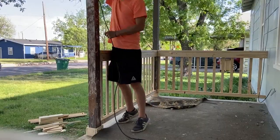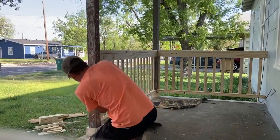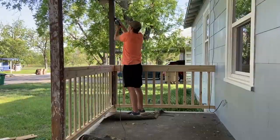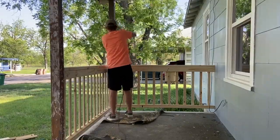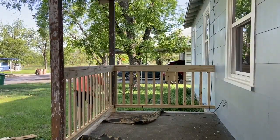To sand off the several coats of crusty old paint layers, I used a grinder with a sanding disc attachment so I didn't have to waste hours with just a sander. This not only saved me time, it worked way, way better — especially since the goal wasn't to get it down to bare wood, but just to get it to a nice smooth finish that would accept a coat of paint.